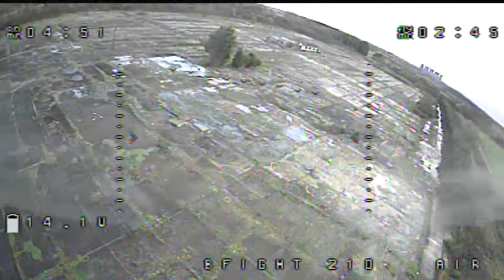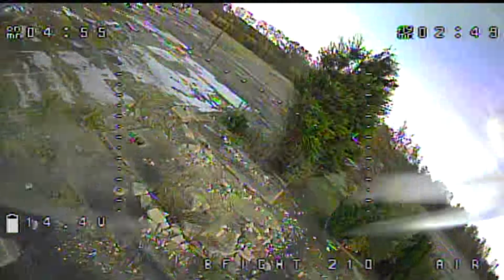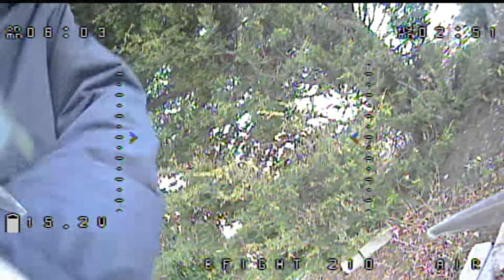This is a 960H sensor, so that's 960 by 480 pixels. I do feel it's a lot better than any of the HS1177s that I've used personally. Colour is realistic, and once wide dynamic range is enabled and auto changed to colour, contrast stayed locked in well in all lighting conditions.